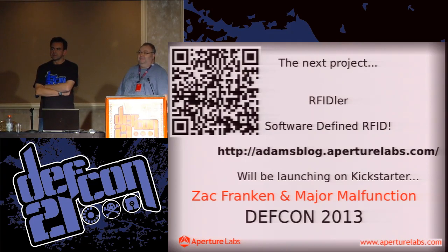Hi guys, this is great stuff, I love it. I have a question, it's kind of a chip implementation question. In a lot of the microcontrollers like the PICs and the Atmels, you mentioned there's fuse bits that the manufacturers can set: burn your code, verify the code, blow the fuse bits and nobody else can read it. Would it be possible with the Decappinator and the probes to reconnect a fuse rather than having to read all the data back out of it? Absolutely. Sweet. Yeah.